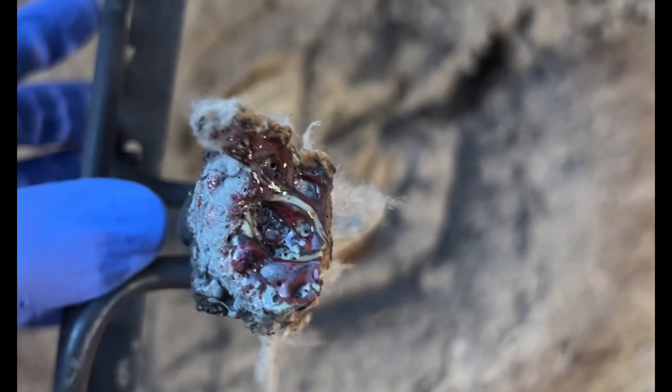And last — this one really got me. When in a hot environment, potassium nitrate will evaporate very slowly and recondense on the cooler areas near the edges, like your electrical terminals. Liquid potassium nitrate just so happens to be electrically conductive. This is a problem because it makes a short between your electric terminals and fries them. Although, a short piece of steel pipe and a lot of furnace cement did the trick in protecting the electrical parts.